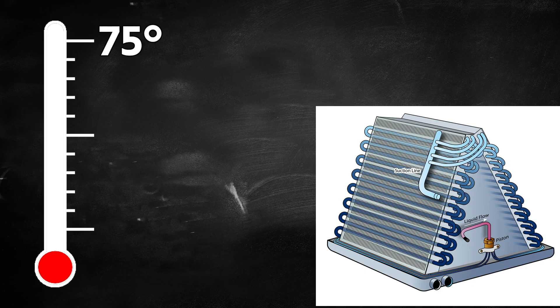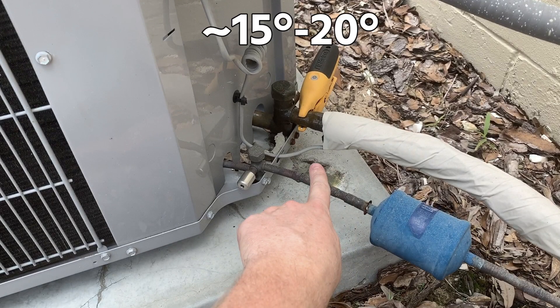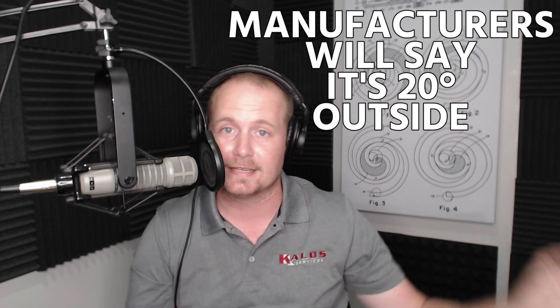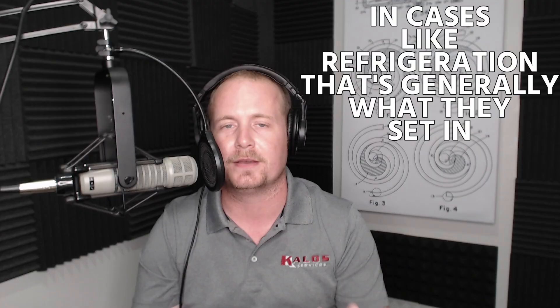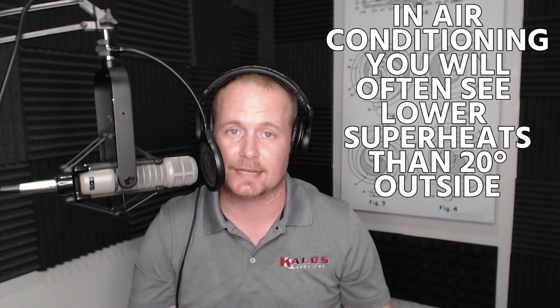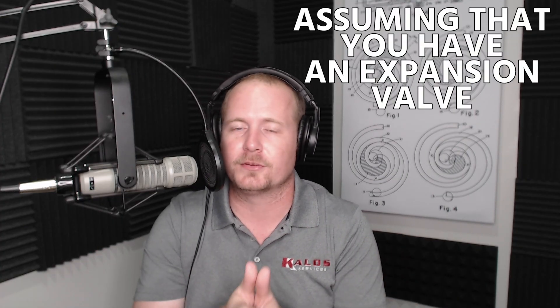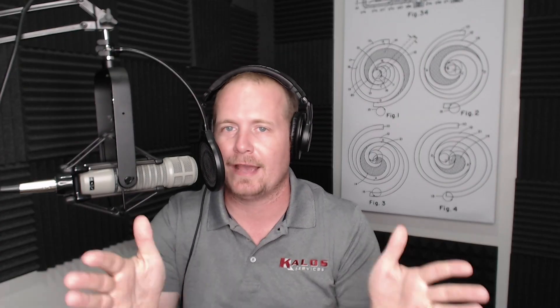Taking indoor temperature 75°F as the top of the scale, subtract 35 to get 40°F, then add in superheat. Superheat at the outlet of the evaporator coil on air conditioning is generally about 10 to 12 degrees. At the condenser outside, it'll be more like 15 to 20 degrees. Compressor manufacturers want 20 degrees outside; in refrigeration that's typically what's set. In air conditioning, we'll often see lower superheats outside than 20 degrees. This assumes you have some sort of expansion valve — with a fixed metering device, all bets are off.